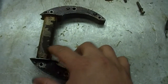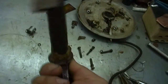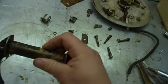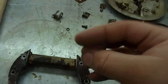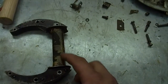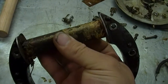I've got the Briggs Model F coil stripped down to its primary. There were 23 layers of secondary winding total — a lot more than I thought. This looks like number 18 wire for the primary. I actually measured the diameter of the secondary: it's 36 gauge wire. In total, my best estimation is that there were 9,550 turns of the secondary, so we'll just say an even 10,000 turns of secondary. It's a lot of wire.